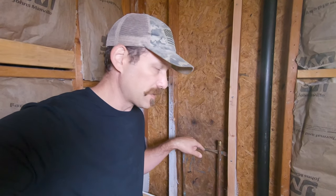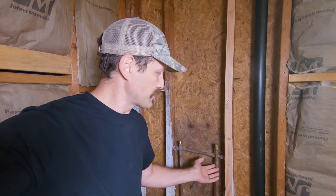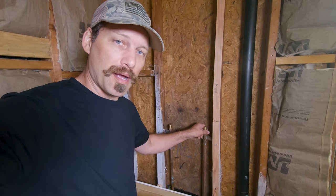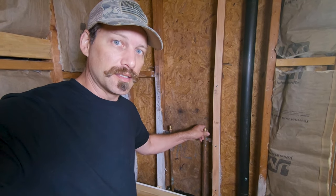When I turn the water off, I open up the hose. It tends to relieve all of the pressure downward away from the house so that there's nothing trickling back in here. The main water line sometimes just doesn't crank all the way off. Turning that exterior hose on allows that to drip out there instead of coming up and dripping through your pipes. If you have that drip through your pipes, you can't solder anything because it doesn't actually recede down and give you the room that you need to make the pipe hot enough to actually take the solder.